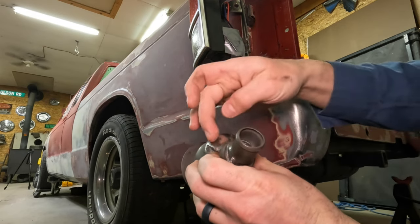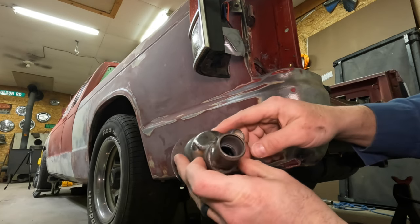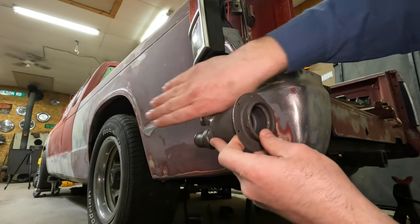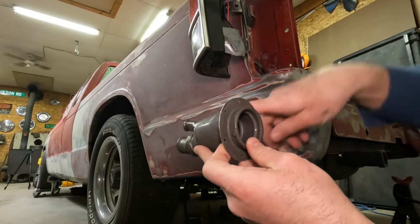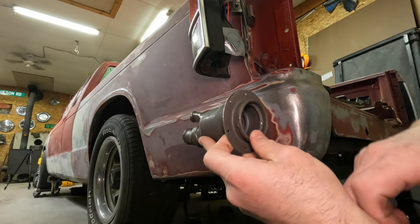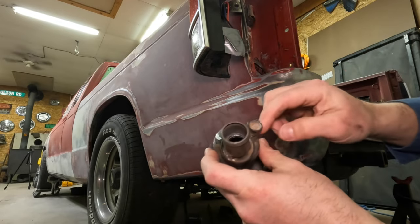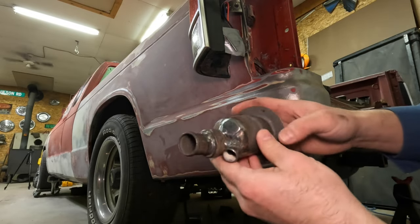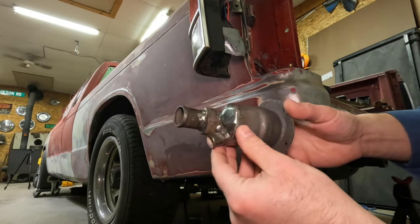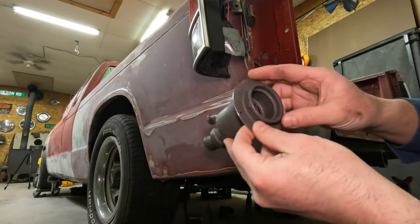And then the vent tube, I had to kind of flip-flop. It's clocking. It was coming out here where I've got this patch. But if that sits here in the bed, I've got this wide open cavity over here that I can run my hose through. And off to the right, that would be poking right into the bed of the truck, or inside the bed of the truck. So I popped a hole, welded that guy in there, and then made a patch panel out of whatever I had laying around from patching up the floors. So that'll be about as snug as I can get this.